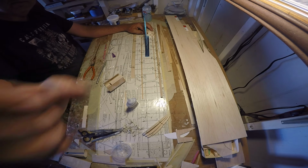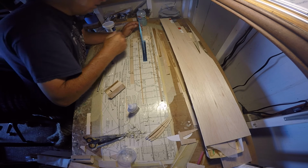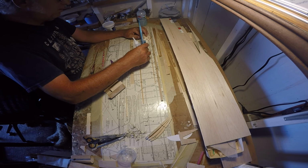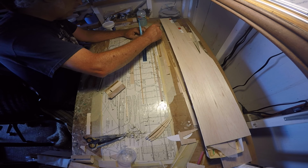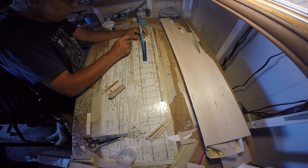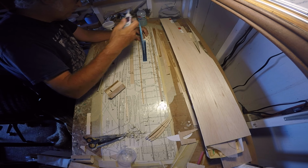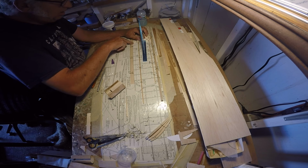Slide the square all the way over, and I'm sorry, I've got a kind of a bad angle for this, but you can trust me, we're going to line this up for square, make sure we're on the mark, and we'll probably hold it against there, right? Keep everything right where we want it, and then just hit it with a dot of glue at every joint. Typically I'll just do fore and aft first. Pin the front and the back. And not too much adhesive, it doesn't need to be swimming.